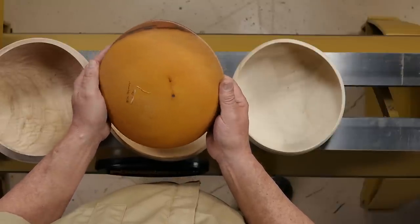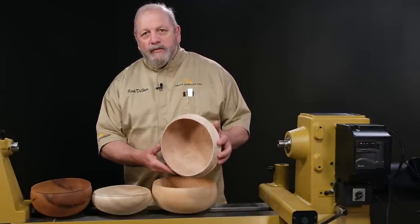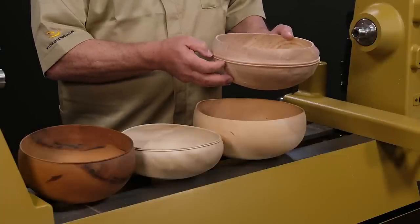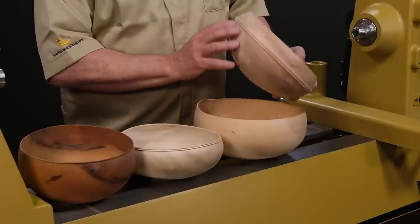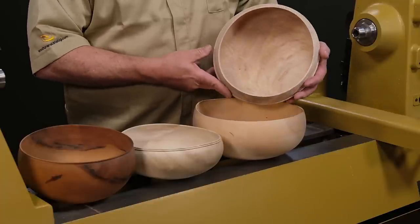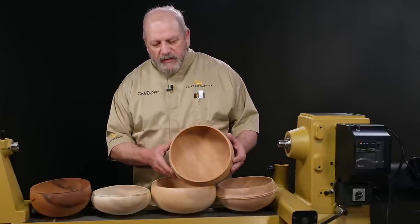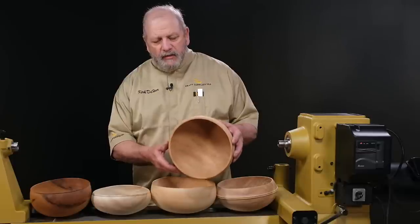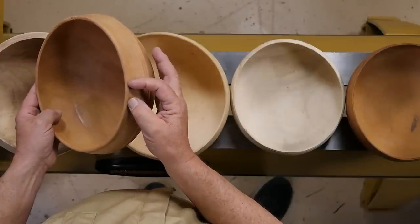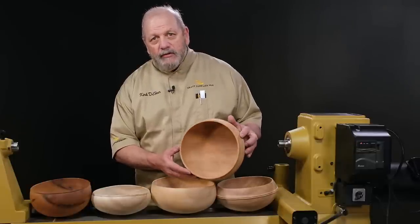Just a wonderful piece. Another piece of silver maple with a little bit of figure in it — this is one that I did. The beads are a little bit lower down around the wide spot on the bowl, which gives it a little tactile feel — it's a little bit more interesting. You can see this bowl is no longer round as the wood has moved. This is another piece that I did — American Sycamore. I've got beads at the wide point and then a bead up on the rim, which helps stabilize it a little bit. Again, all off the tool, no sanding.